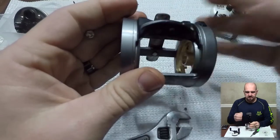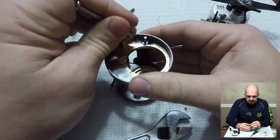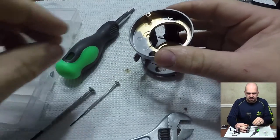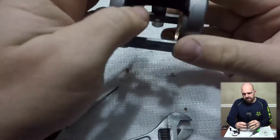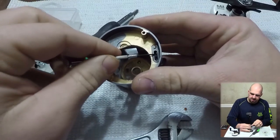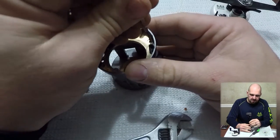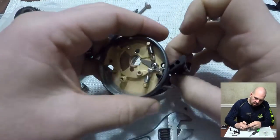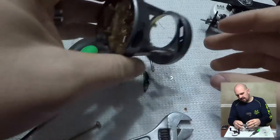So we are going to remove the thumb assembly here. Again, that's going to use a circlip. Pull that loose. Put that in your bin. Behind there's a washer. Make sure you save it. Once that's done, you can lift this retainer up and out of the way. Put it down through there. Pull that loose, and your thumb assembly will come out.